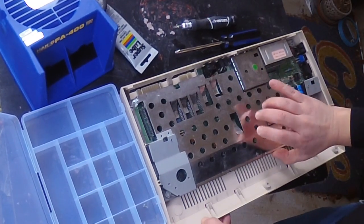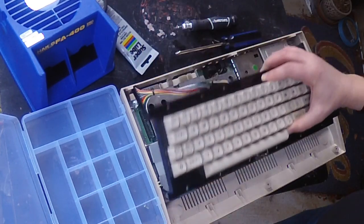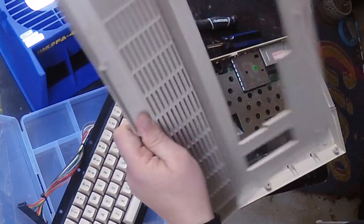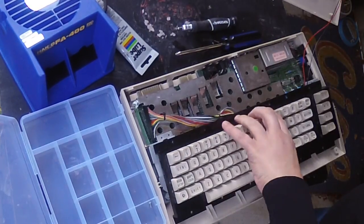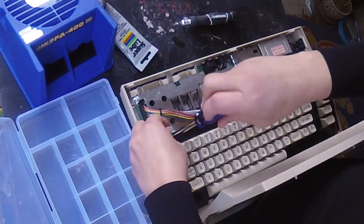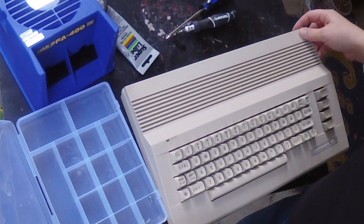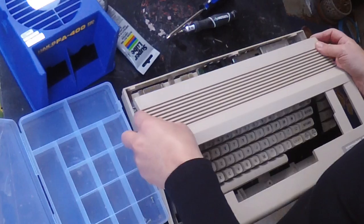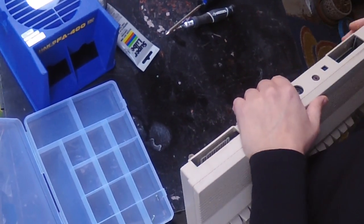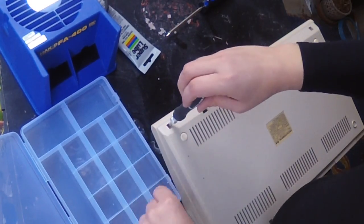The motherboard is totally intact with the case. I'll put the keyboard back — make sure to get the front groove of this keyboard for the C64C under these little tabs before plugging in the keyboard. I want to plug in the power LED first, and then finally these little keyboard screws. This is the last part — I really want to be careful not to break these tabs, so I'll put this right under there. It got all snapped in gently. Finally these last three screws. That's it.